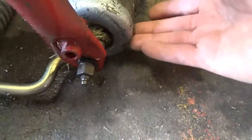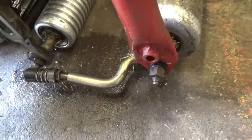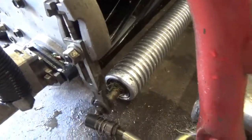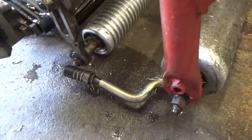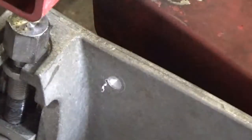When the front roller gets banged into something hard, it stuffs the tension rod and kinks it, and then everything is off. So that'll actually make the reel at an angle where you're cutting. That shows how it's a good idea to get as much lift as you can out of these when being transported.